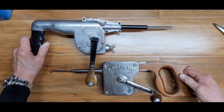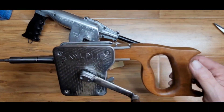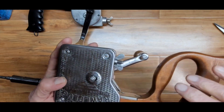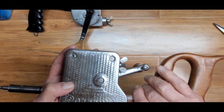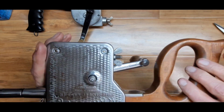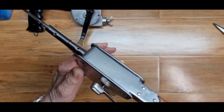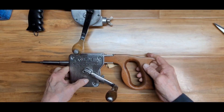For comparison, here is the 1950s version that Raw Plug had made in England — updated with aluminum housing, works very similarly. I've drilled with both of them and don't see a lot of difference in performance; they both perform very well and do what they're supposed to do. This was just updated for more durable materials — aluminum housing instead of the earlier configuration. This one's about 70 years old and this one's about 90 years old. One thing on this tool I couldn't repair: the tool works from either side, but on the right-hand side, the bolt that holds the turning mechanism operating the hammer motion is sheared off. I don't know how to get another one unless I have one custom-made in a machine shop. So I found a way to get it working on the left-hand side — it's a left-hand operating drill instead of both sides. I'm ambidextrous, so it works for me.